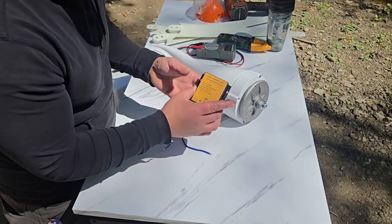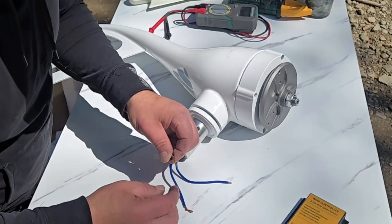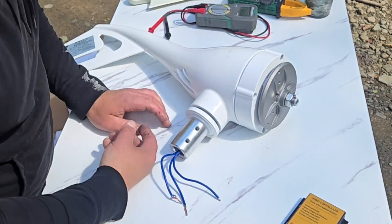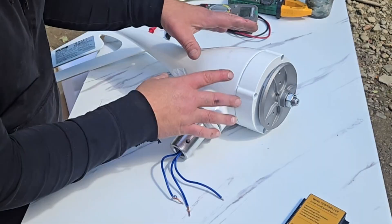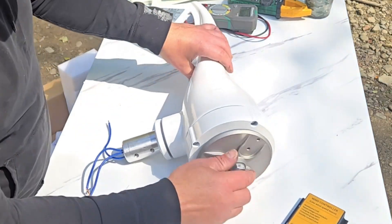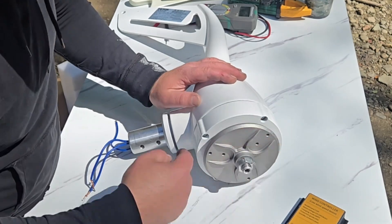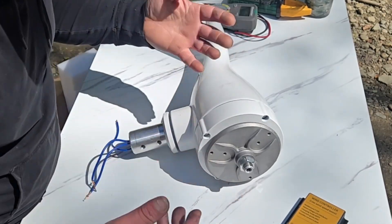Converting to DC and then back to AC is a huge efficiency loss, but it's just the way it is. What surprises me is we actually have pure copper wire on this - I really expected to see aluminum copper-coated wire, which you find a lot with cheap electronics. These are actually pure copper wires. This is a permanent magnet generator - either the rotor has permanent magnets, and every time those magnets pass over the copper windings on the outside, it induces an electrical voltage through those windings.